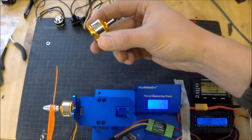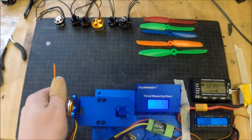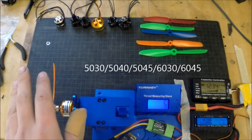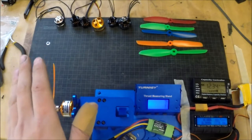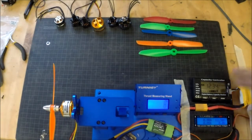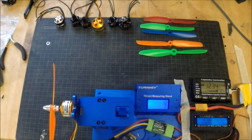First up is this motor, the mystery. I will be measuring them from that way and up to that way. It will be short videos, and then I present all the results down below. There will also be a link to a Google spreadsheet where I actually collect every data. I will be measuring how many amps is needed for delivering roughly 150 grams of thrust, and also maximum amps.